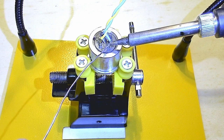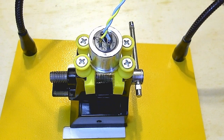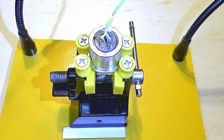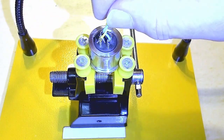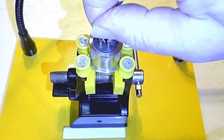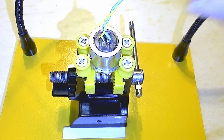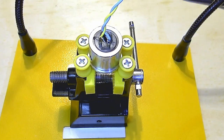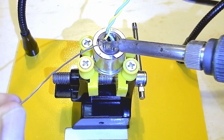BumbleBee Pro Audio recommends that when you're soldering a male XLR plug, to plug in a female XLR connector to act as a heat sink and a stabilizer for the XLR pins in case the plastic starts melting. I didn't do that because I have a very good soldering iron and I feel confident in my soldering techniques. But if you have a soldering iron that doesn't heat up efficiently or you're new to soldering, it'd be a good idea. A soldering iron that doesn't heat up quickly can be more damaging than a hot soldering iron because you'll hold it on the part longer to get the solder to melt. This is how you can damage the components.